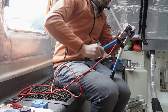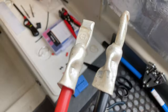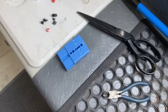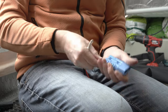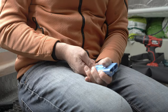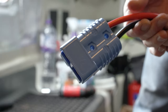Using the same connectors and process, I need to make a 3-metre extension to send all this power to another part of Allen's innards. Despite using a hex tool, my crimps aren't hex nor very pretty, but are very effective — no amount of yanking can release them, and there's perfect continuity. With these thicker wires, I was able to click the pins into the housing with just the force of a thumb. You do need to make sure the pins are in the right orientation, as they can half-click if the wrong way up, and you only find out when you try to mate two connectors together.